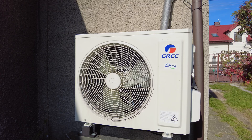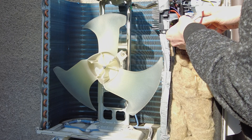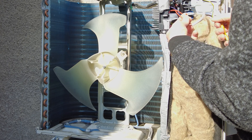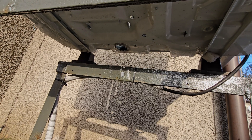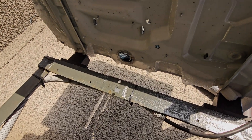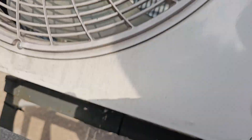So I decided to make an easy mod — which for sure ends the warranty on my split, but I don't care because these systems very rarely have any issues. On the screen you can see a red wire which powers the heater inside the big blue cable. I cut the red wire and added a simple switch to manually control the on and off. For the last 3 months I only twice turned on the heater for 24 hours to get rid of excessive ice on the tray. So I saved at least $100 on my energy bill.